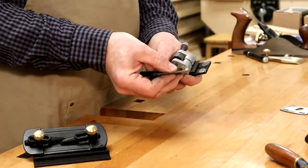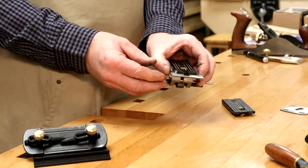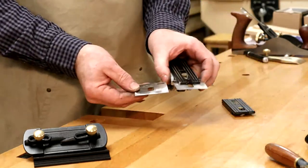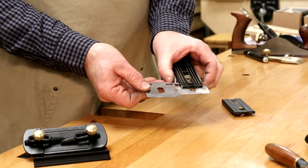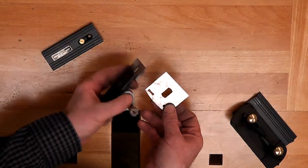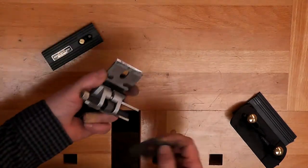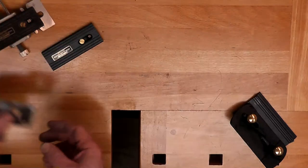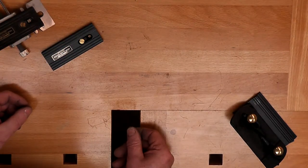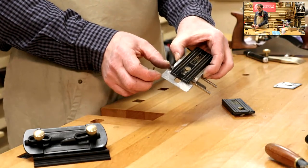Biggest problem I find is getting my protrusion length set up right. Now, the spoke shaves in here seem to vary a lot if you take different blades, the different lengths. Trying to get a 30 on those can be problematic to set up because the blades are different sizes. All plays certain issues. We got by with it. This one, when I started looking at it the other day, was up to something like a 38 degree blade angle because it's come back so much in length, a lot shorter.